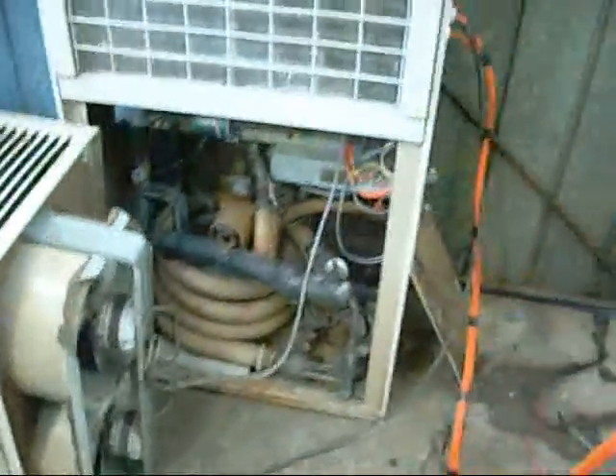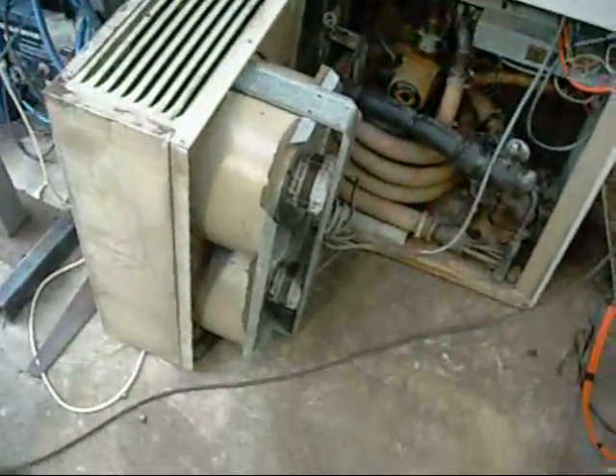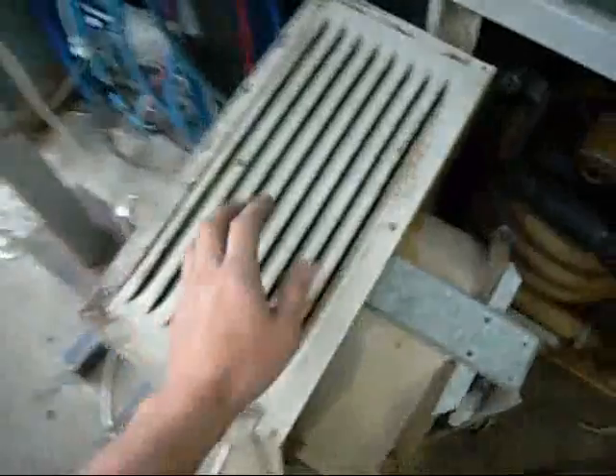That other one will be trying to start but it's because I bent the bracket. It did move before I put it down and bent it. It's actually a downdraft fan — it's blowing at me, not up the top. That explains why there's so much crap stuck to the coil. It's been picking up all this foam dust and impregnating it inside the coil — no wonder there was no airflow coming out.